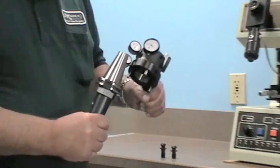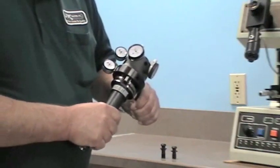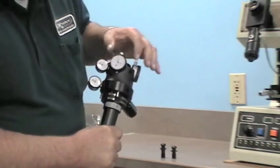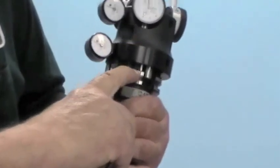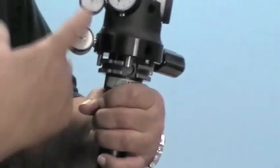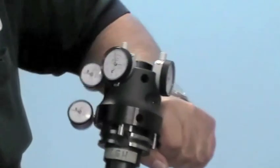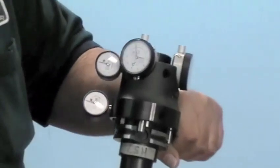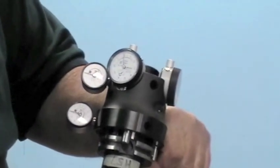I'm going to install a standard holder that you would normally buy anytime, anywhere, into our test gauge. Right now I am setting zero on our dial indicators — I'm reading a height off the flange down to the bottom. These two dials are reading into the taper. They're dead smack lock solid; there's no movement whatsoever. I'm going to now remove this and install a standard retention knob.